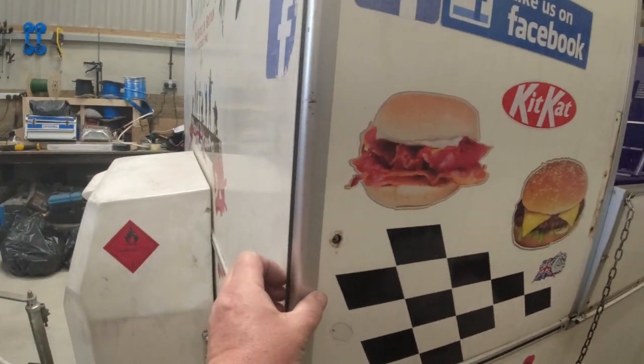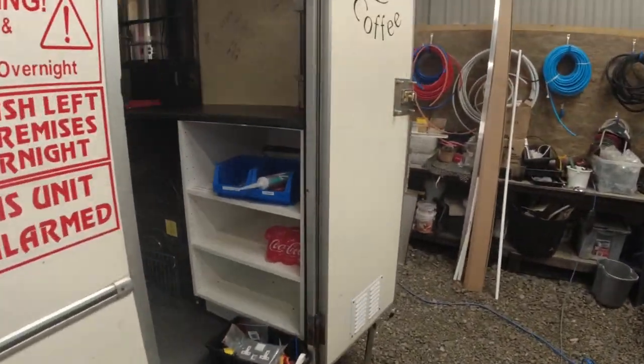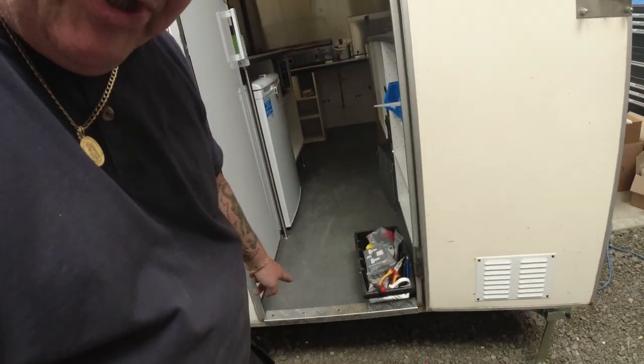Selling Covey on the hop like that really threw me. And the other thing we've been doing is this food trailer. These are built out of box section steel — 25 by 25 mil uprights in four corners, and 25 by 25 mil box section either side of the door. They're held together onto the chassis by six points. We picked the trailer up, thought it was fine, got it back here, and on close inspection it was only held on by two points. The two front end box sections and the two door pieces were rotten away, so it was only being held on by two points.